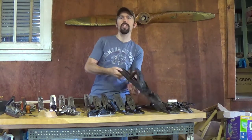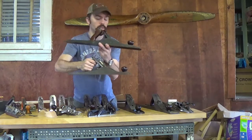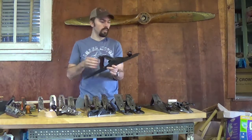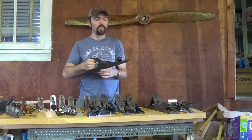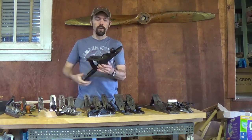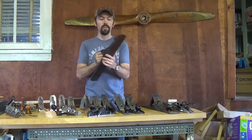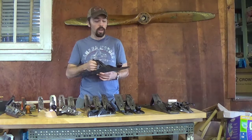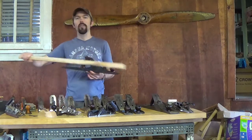Moving up, we have a number seven. We just had a six — seven is obviously quite a bit larger, and this would be the first of what we call the joiner planes. The usual use for these is edge joining. I've seen craftsmen use these as smoothing planes before, but they are fairly heavy — probably close to eight pounds or more. This one's very sharp and works very well, but it is kind of heavy and it wears you out if you use it for long periods. So for that reason, a lot of people just use this for edge joining.